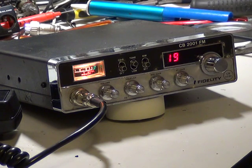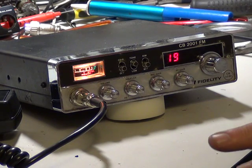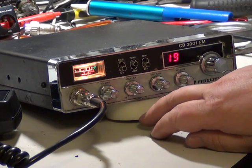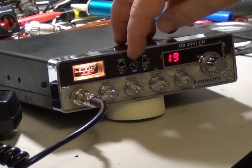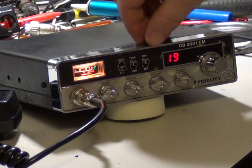It works very well. The receiver is exceptionally sensitive. Nice sets. It uses the Cybernet PT BM1002 AAOX chassis, as the Amstrad does, as the Mustangs do, as the Transcoms do. Harvard 402, the Harvard base stations, and they always work well. You've got volume squelch, which is switched down to the PA position, mic gain, RF gain, channel 9 switch which displays channel 9 on this type of set. You've got tone high and low, and then you've got a display dimmer which just affects the LED.